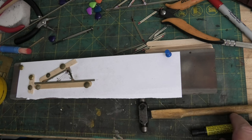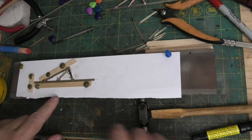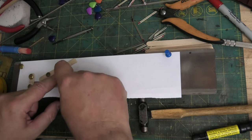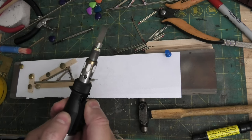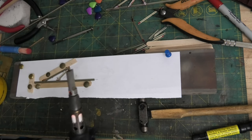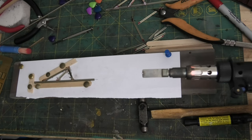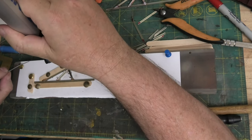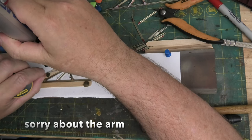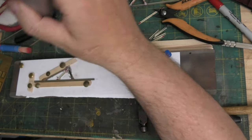I need a little bit of flux on each end - you can't have too much flux, well possibly you can, but not in this case. Gas soldering iron, wait for a minute to get that hot. Now it's hot, I'll just place that on there and warm this end up first. Just get in there - there we go, solder has flowed.